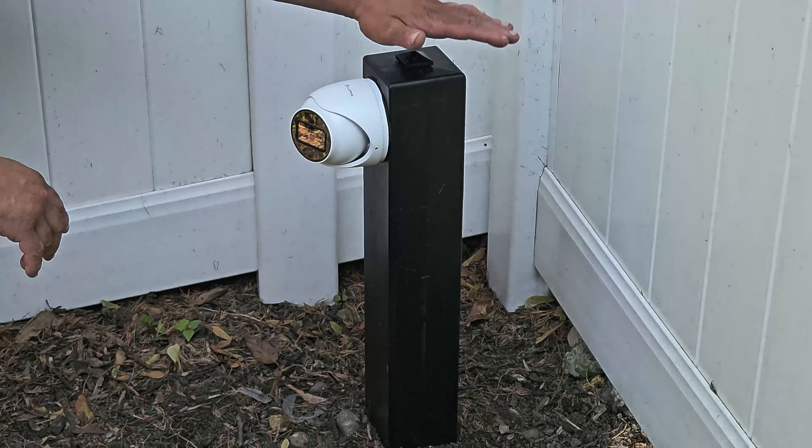We just got word from Gus to check out the camera, so let's take a look at his work. Gus just finished installing that 39-inch Arlington outdoor garden post with an 8-megapixel Luma X20 camera — turret version. The reason this camera is here: the client's got a camera over there that has a shot of this gate if somebody goes through. But he wanted this one here for a focal view of this specific area — he wanted to see people coming in and out. He's got workers like garden people and pool people coming to take care of the garden, landscaping, and pool, and he literally wanted to see them going in and out of the door, since these services happen whether he's home or not. He wants to verify the billing matches the days the workers came in.